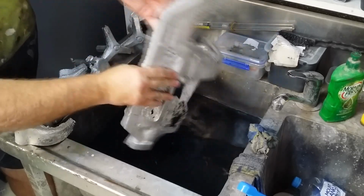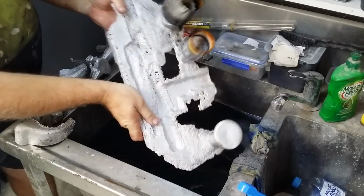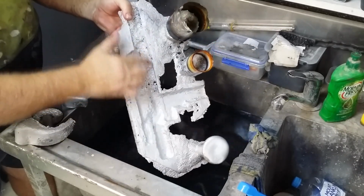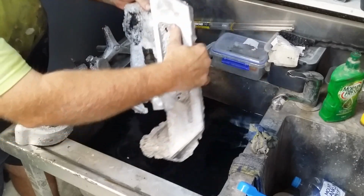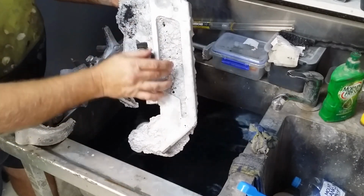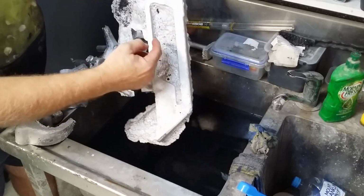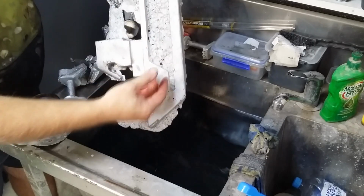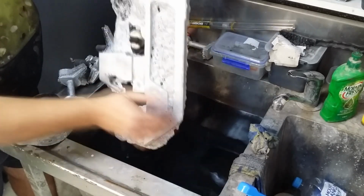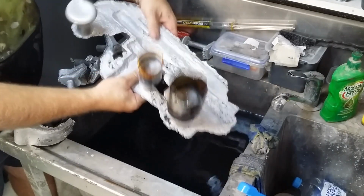And yep, it's a failure. Aww. Unfortunately, what has happened with it is I had some sand fall out of this middle section, and when I was looking at it at the time, I thought that it was really just going to end up being a paper thin area of flashing on the inside that I could then cut out with a mill. As it turns out, that's nearly as thick as the thickest part of the pattern piece itself, and as a result, when I've poured the metal in, I've come up significantly short with the amount of material that I had.